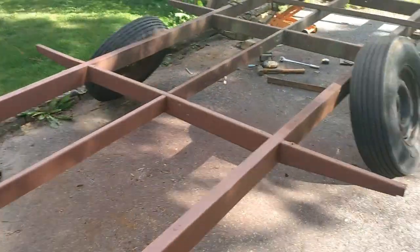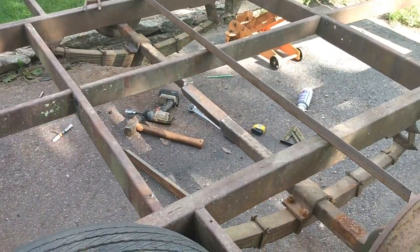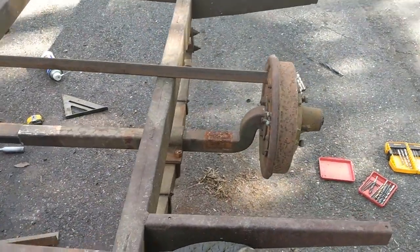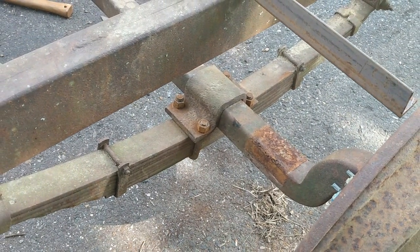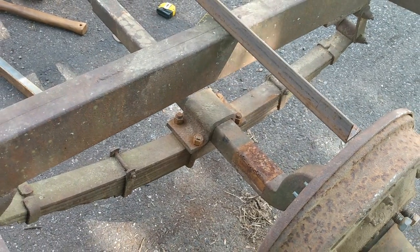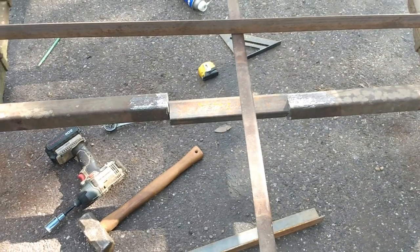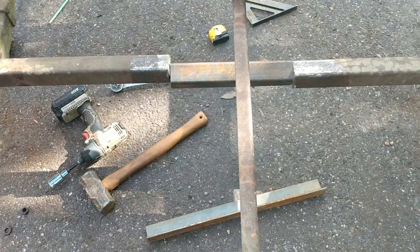And then I've got the axle cut apart. I've got the block in there temporarily. I got to line everything back up. And I widened that 6 inches on each side underneath that axle there. Between the axle and the spring was a little tab, a little dowel, and I had to drill into that axle half inch, and got that. Looked like I got it about perfect. That piece of square tubing there was exactly 12 inches, and it fits perfectly in there.